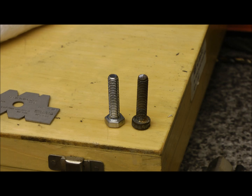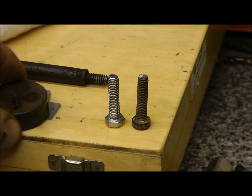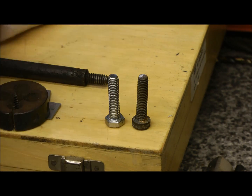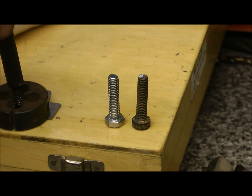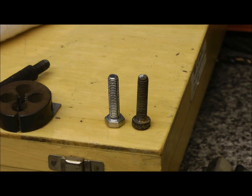Except the only Whitworth die I've got is this old Warrior, which is a 5/16ths — which is fine, unfortunately it's a bit slack. I need a quarter, and I'm not going and buying myself a quarter die — clearly about £5 plus postage on eBay if you just want the one. So without further ado, I'm going to have to make one on the screw cutting lathe, but you'll have to bear with me a bit, because it's ages since I've even dreamt of doing anything like that.